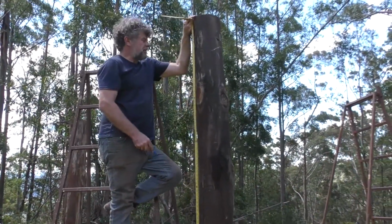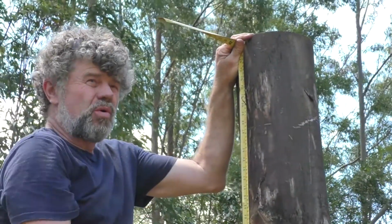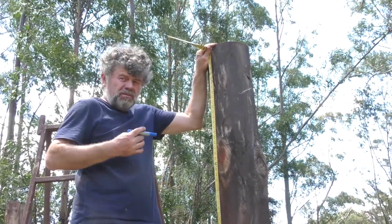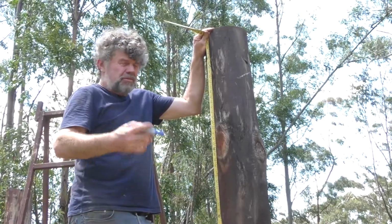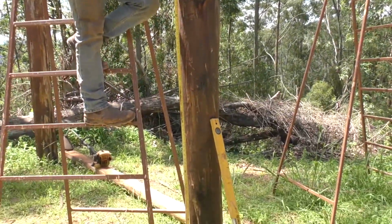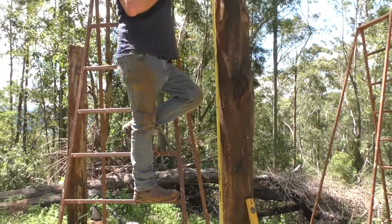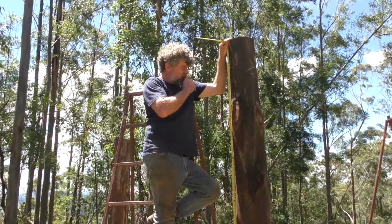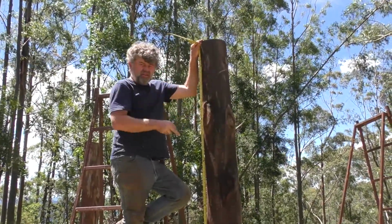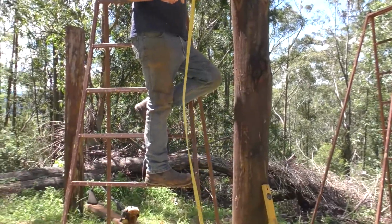What do you reckon? Well, if we make the ceiling height like 8 feet over here, yep, 2.4, which is a bit high because it can let the weather in or whatever, but it'll stop your tent from cooking. Yep, because the roof will be up off it. And if you do get too much weather in here, you can put a bit of a wall down on this side at the top. Yep. No, it sounds good to me. I always wanted it a bit higher than too low. Yeah. And I reckon we make the other side 150 lower than that fall, like 6 inches across there. 6 inches, yeah. So what was that total distance again? In height? 2.4. 8 foot, which is a standard ceiling in a 3-bedroom house these days. Yep.